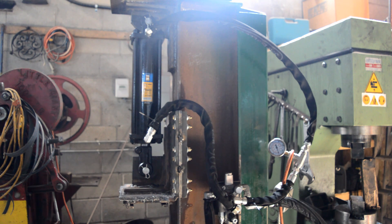This is a 16-ton press when run at 2,500 PSI. Right now I'm running at 2,000 PSI and I'm getting almost 13 tons of force. For what I've been playing around with, that seems to be very adequate.